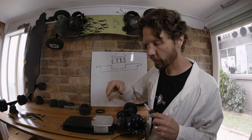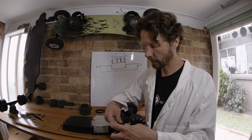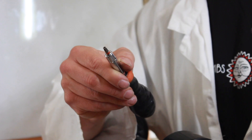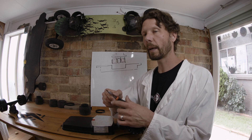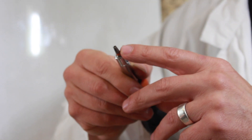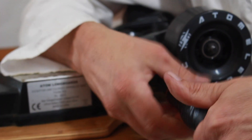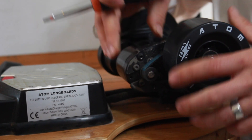So what do you do? First thing is you need to take off your pulley cover just to get access to where you can get to the adjustment screws. So the pulley cover comes off. These are Torx bits, and Torx are great for actually getting high torque without stripping anything — better than hex keys, better than Phillips potentially. It's a specialized bit, and one thing that's potentially a problem is if people don't actually have these, they'll need to go out and buy a set of drivers. But all our stuff is coming with Torx bits. With that, your pulley cover comes off.